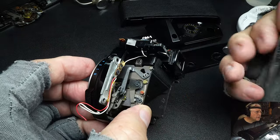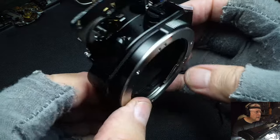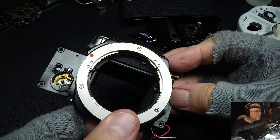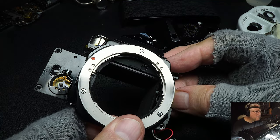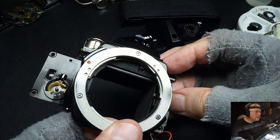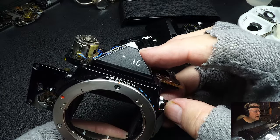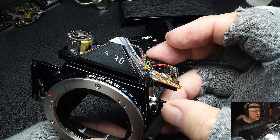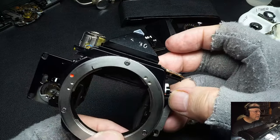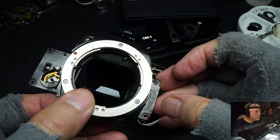Over here, the lever is controlling the mirror. I'll fire the mirror — push that forward, press a lever right here, and there it goes, you can see it popped up. The exposure system doesn't know exactly what to set the exposure for with that silver lens mount and all the black inside, but I may be able to lighten it up in Vegas Pro. The prism was computer-designed and very small — much smaller than the Nikon or Minolta — which made the camera very light. That was the whole point of the OM-1: to make it small and make it light.